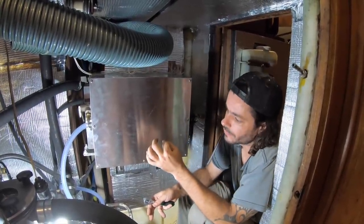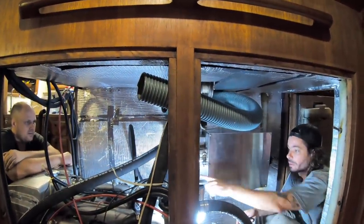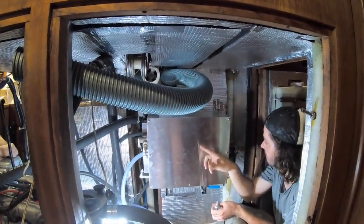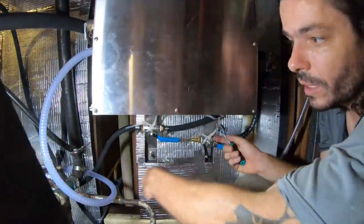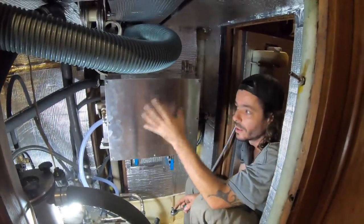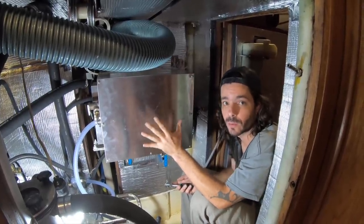We have a thin aluminum pipe running around inside of this tank, and the water comes in from here, and from the bottom here there's another hose, so the water circulates inside of this aluminum pipe and goes out through here. So we have two hoses, one in and one out, and we have the choice of closing the valves. In this way, we don't circulate the water here. It's just because we don't want to keep making hot water if you're not gonna take a shower. We're just gonna turn on the heater when you're taking a shower.